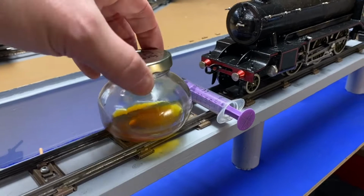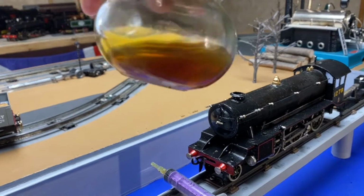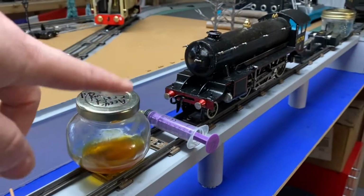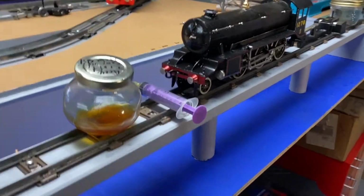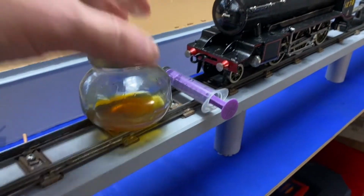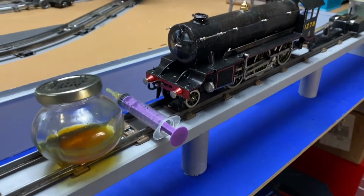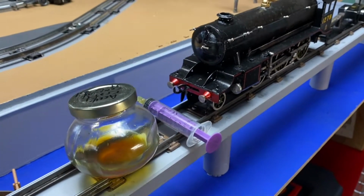This is AccuCraft steam oil, and I've got different steam oils here. I've got a lighter weight steam oil and this AccuCraft stuff. This locomotive runs, for me, better on this heavier weight oil. Your experience could be different. It's goopy because there's some petroleum product in it, but most of it is rendered animal fat, and it's designed to emulsify, mix in with the steam.